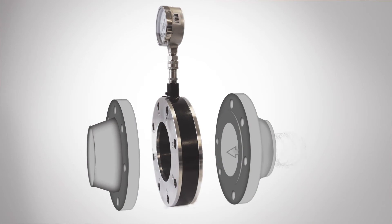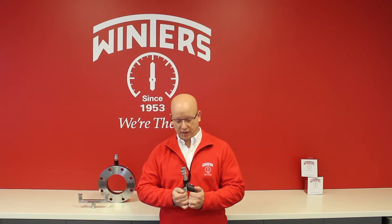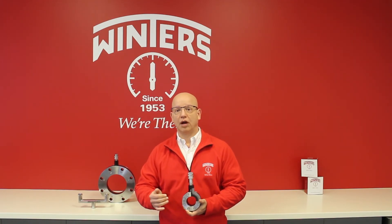The elastomer houses the silicone fill, which is an incompressible fluid. As the slurry material enters through the isolation ring, the elastomers expand and contract. This process also continuously cleans the isolation ring.